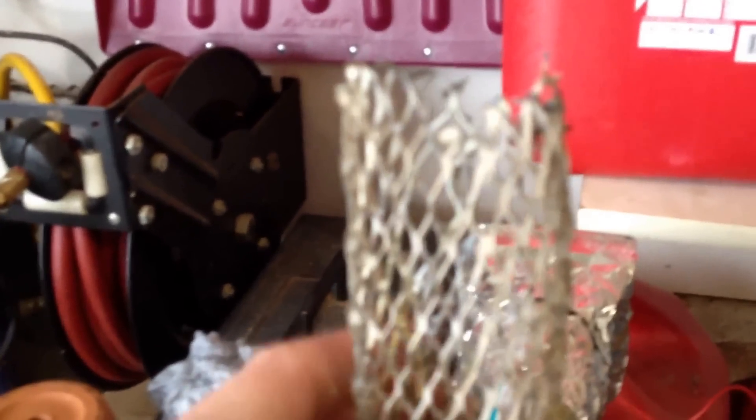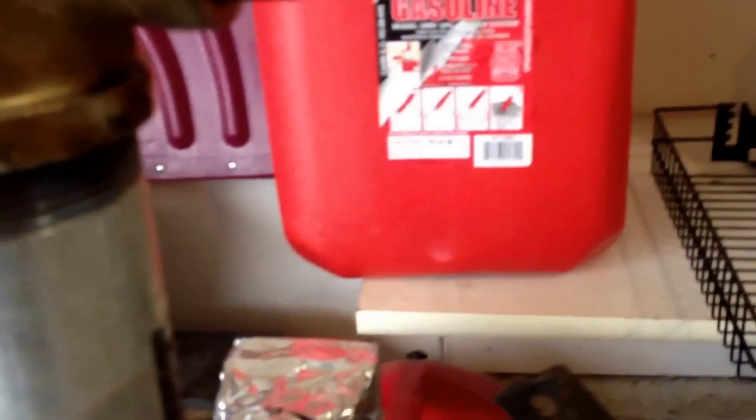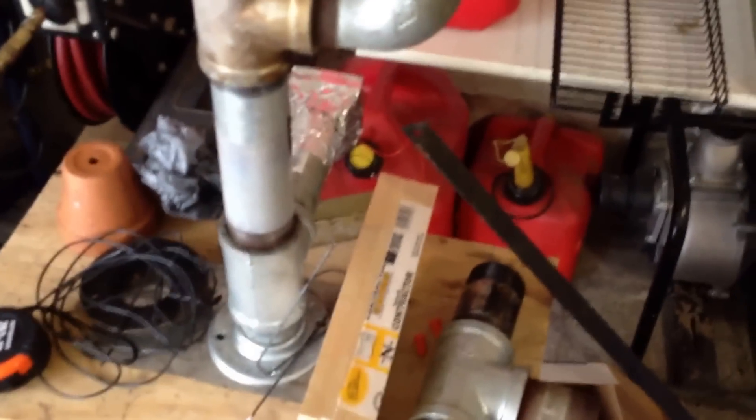This one I'm using an even smaller, just one of the square cheap PC fans. If you watch one of my other videos, I had to use this expanded metal if you're using pellets. If not, you can take that out and just put wood shims in and they work really well. That just sits in and then you fill the pellets up and the air flows in and up around that expanded metal. That's how I got that working.